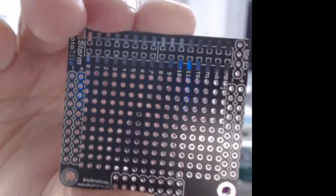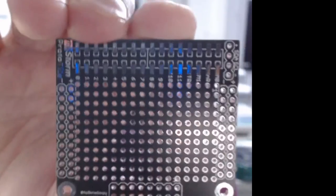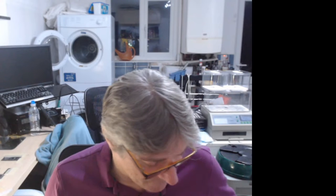So that top one there is a 0.1 inch header, surface mount, 0.1 header on. And then on the other side, of course, you've got the normal tile 0.05 inch header, 1.27 mil. Nice, it didn't like to focus on that. Just too close. So that will go down with that header down, and then you can actually add a header on top, plus all the IO lines are on the first row, and then you can solder those in. It works much like the previous proto boards that we have.